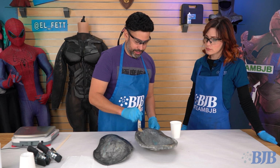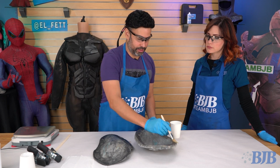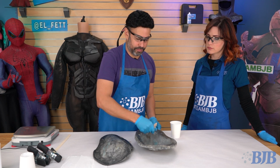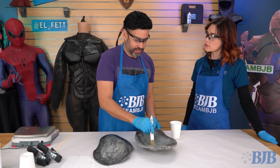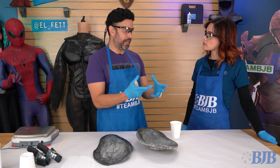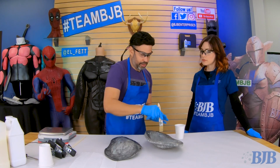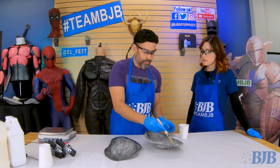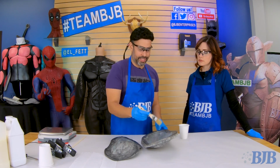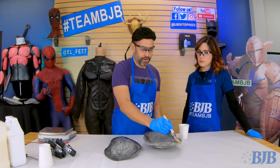As I was having a lot of trial and error with the universal spray, I decided I'm not going to use anything universal. I'm just going to use the friendliest thing for urethane foam. So I found that to be wax. I tried some generic wax coating that you can find at Lowe's or Home Depot, doing a few coats of that, and that was working all right, but then I found the liquid wax to be easier to apply with the chip brush, get it everywhere, all the nooks and crannies. So far it's been working for me.